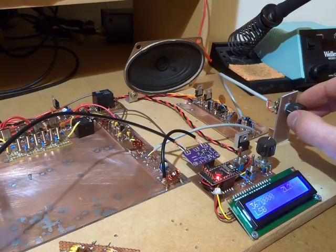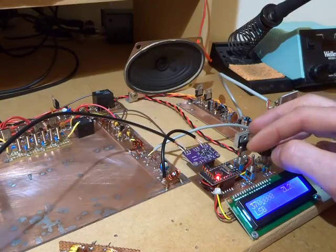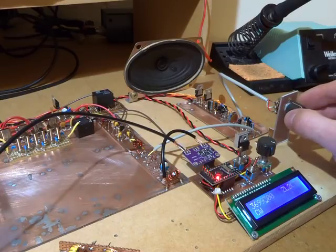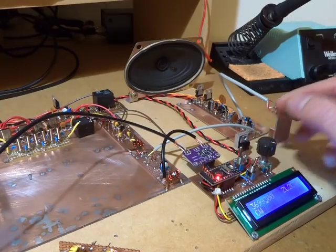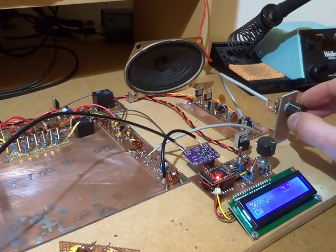80 is, like I say, quite noisy. It's an Australian station. A bit of Morse going on there. It's got a CW filter. It seems a lot better with the atmospheric noise cut down by the narrower bandwidth. It's easily copyable. So that CW filter seems to be working quite well.